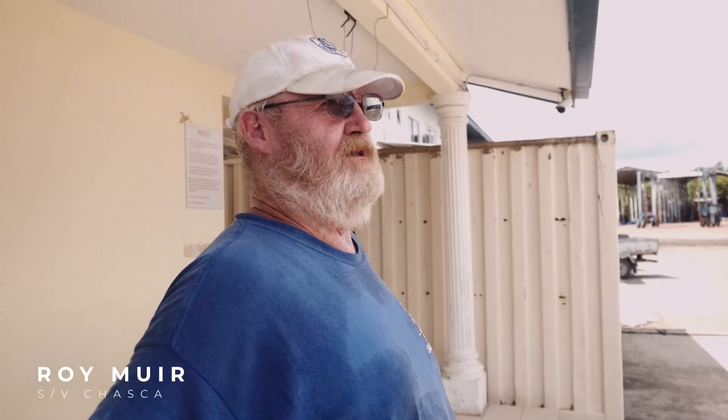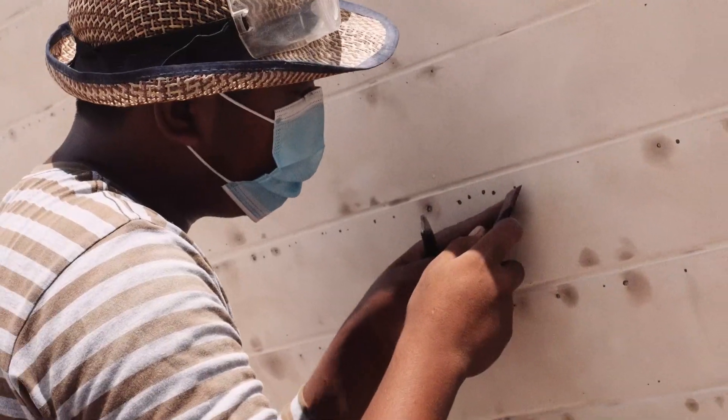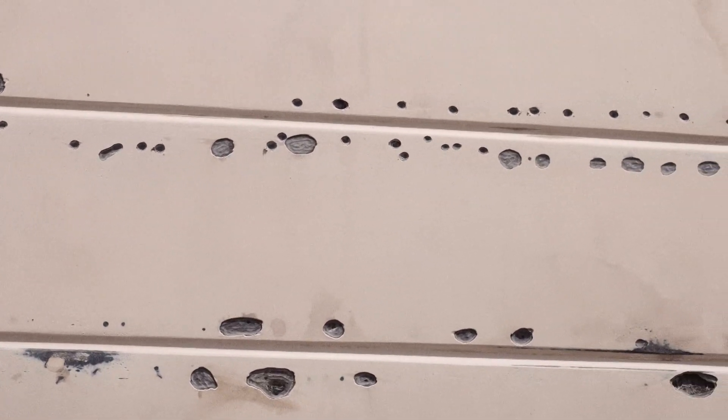About a year after getting the boat, Roy started noticing little blisters in the top sides - nothing below the waterline but just on and above the waterline, above and below each groove in the imitation planking. He suspected osmosis. After sanding the old paint off, it was confirmed as the start of osmosis but it's pretty fine - in the gel coat rather than the glass. He's drilling through the gel coat back into the fiberglass to make sure they've got it all, then drying it out. He's using a Dremel to grind them out, flush them with water and patch them up. There are a lot of them, but nothing like the osmosis treatment we did with ESPA.